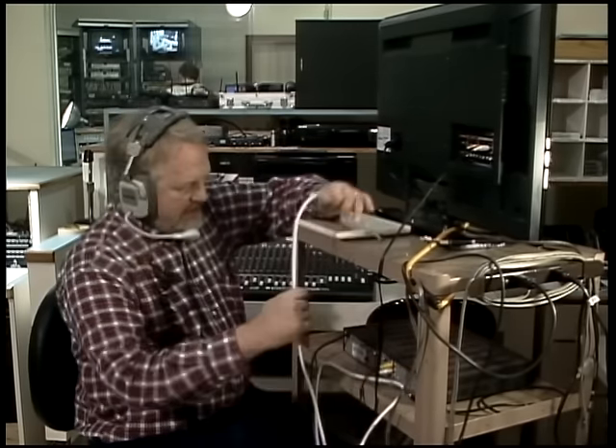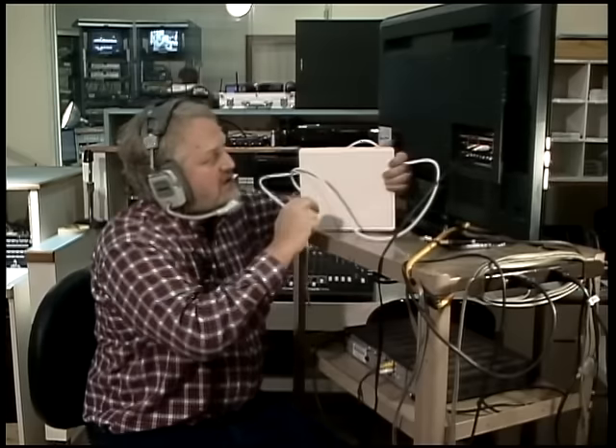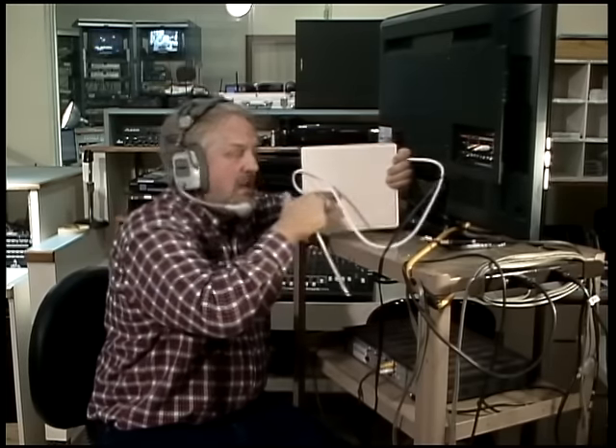So you can get WTJR. Now one of the easiest ways to do this — here's an indoor antenna; this could be a bow tie, rabbit ears, or an outdoor antenna. Just remember channels 7 and 10 are VHF channels, so this is a UHF antenna. UHF is smaller, VHF is a little bit bigger — that's why rabbit ears are VHF and bow tie is UHF. If you're going to get both, you need the kind of antenna that gets both of them.